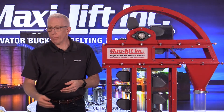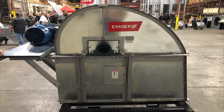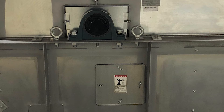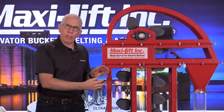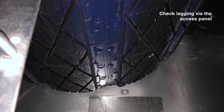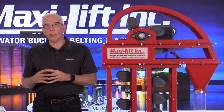Let's look at some photos — thank you to Chief Industries who allowed us to come to their dealer days. The first photo shows the head section in the warehouse. There's a small door just underneath where the head pulley would be, underneath the bearing. That door allows you to look up underneath and see how good the lagging is — you can't see it from the top, only the edges. In these photos you can see the lagging is brand new and in good condition, with the retainers visible where they come around and meet in the middle.